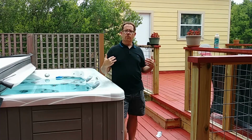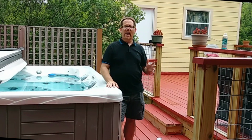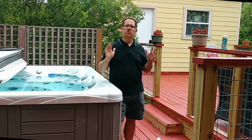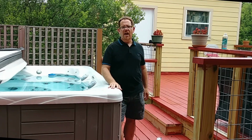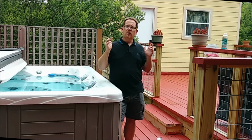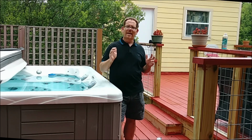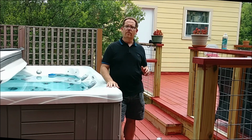I had a biofilm problem a short time back, and I knew it because I was having to add shock and sanitizer on almost a daily basis. That's way too frequently. You shouldn't have to add those things anywhere near that often. I knew I had the problem. I used a special cleaner designed to get rid of biofilm, and now I do this each and every time I drain my hot tub.